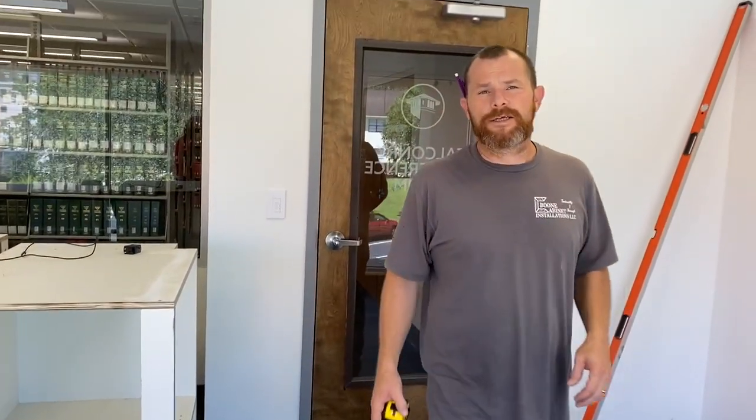I've got an additional 3/4 inch toe kick that's finished that goes on the front, so I left myself a little bit of room for error. You can make it 1/4 inch over and you don't have to worry about it, because you've got a toe kick that sits on top of the carpet.